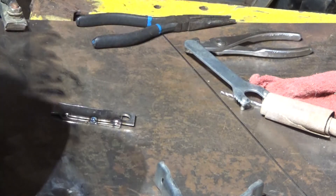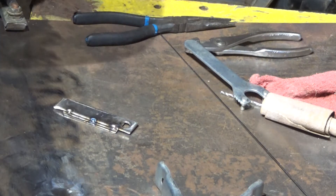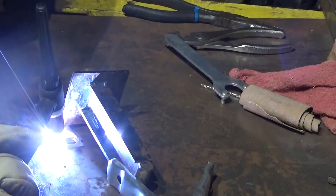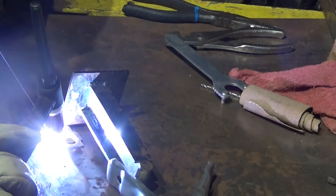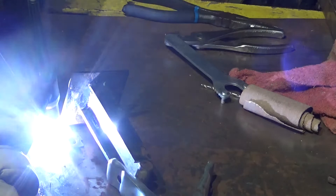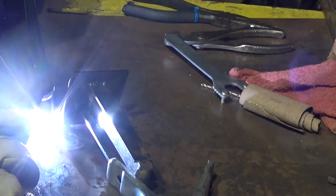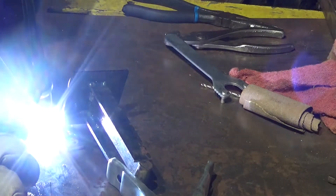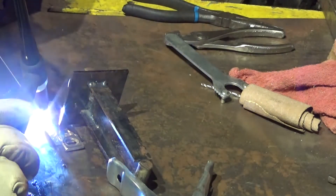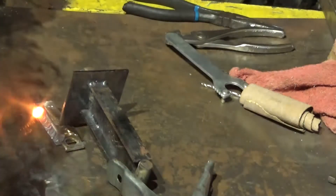It looks normal, looks like steel — has a little black stuff around the edge. The piece on top is the thicker piece at 90 thousandths and the lower piece is 60 thousandths. There is somewhat of a gap so it's a little hard to do this efficiently. What I do is kind of hang out on the top, get it hot and ready to melt, then jump down to the bottom and oscillate through. It's probably not the best method but I'm able to do the weld. My travel speed is slow, it's kind of erratic, and I burnt off the top edge a little too much, but whatever — it's my first time welding stainless.